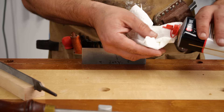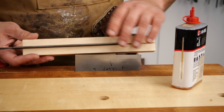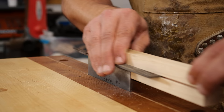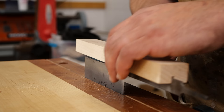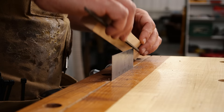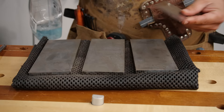To get started and get it square, I put it in a vise, put a little oil on a rag and rub it on top — that helps with the sharpening process. Then I take my file that's in my block of wood and rub it over the top making sure it's square. You'll see it get a fresh clean surface on top. You can feel a burr start on both sides, then take the file and do the edges. That's perfectly square. I make sure the corners are a little bit rounded so they don't have a sharp edge, which helps your hands and keeps the corners from digging into your work. Feel it to make sure there's no burr and you've got a nice clean square edge.